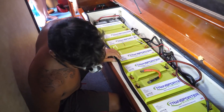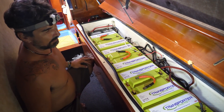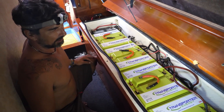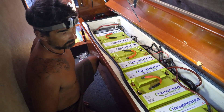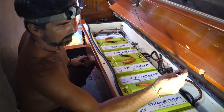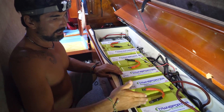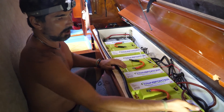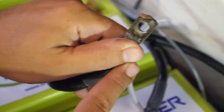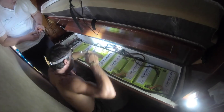When you're doing this, is there ever any risk of getting shocked? Well, it's DC voltage and it's pretty low voltage. If it was like 48 volts or above I would worry, but at 12 or even 24 volts you'd literally have to bathe yourself in salt water and touch a bunch of things wrong. I've actually never been shocked doing this. What I watch out for is I always tape the positive ends — because if you're hooking them up differently, you could have one negative end with another battery connected and maybe arc. I think it happened to me once. You can see the end of this one — how it's just melted.